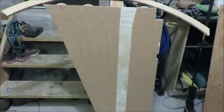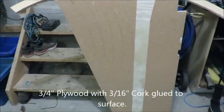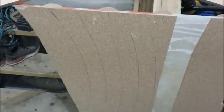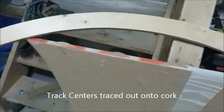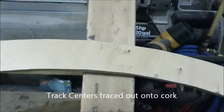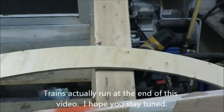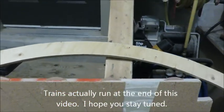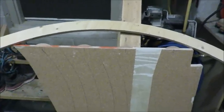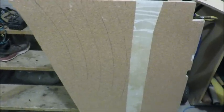Shown here is one of the pieces of plywood I use - three-quarter inch plywood - and I started tracing out, as you can see with the lines there. I made extensive use of this piece of plywood; it's a template that I cut out. It's got a 28-inch radius on the inside and a 30-and-a-quarter-inch radius on the outside - those are the two main radiuses I use for the main line. I make extensive use of that template and traced out everything on the plywood itself, then cut it to size to fit the main lines.